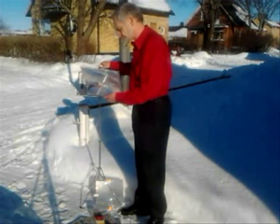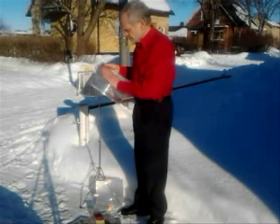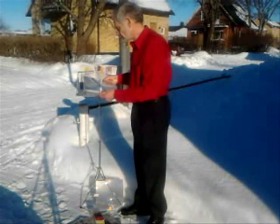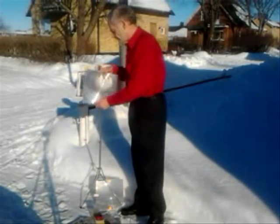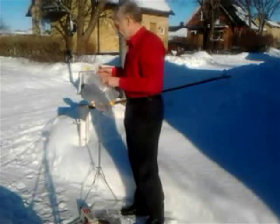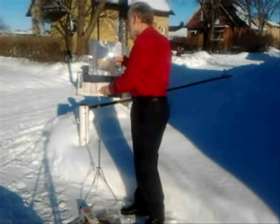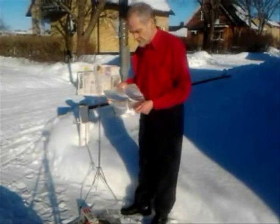I noticed it was pretty thick, and it was smooth on both sides, so it was apparently two Fresnel lenses that were put together. So I decided to cut off the edges and divide it up, and I got two Fresnel lenses like this. And when I tried that out and got it to focus, it got things burning really fast.